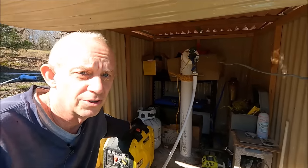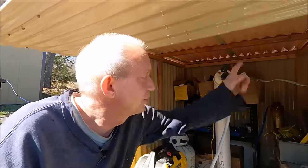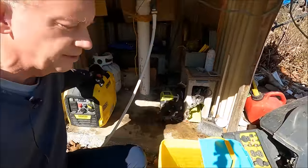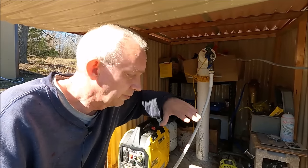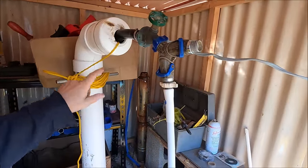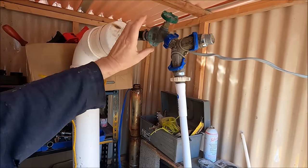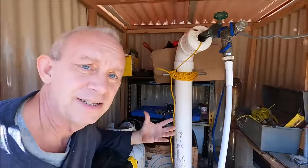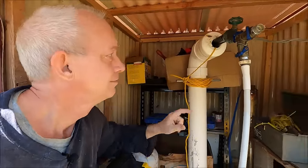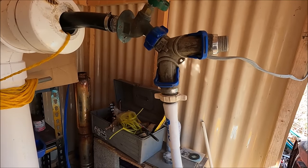I have a light switch here which runs down to the inverter. Each day I come out, turn on the inverter, walk down there — it's 100 feet down and 100 feet back up the hill — then I come up here, turn on the switch, water shoots out, and I let it run for a couple seconds into this bucket to make sure the water is clean. Now this well used to get dirty all the time — surface water would go down and contaminate it. Another issue is this pipe or the well pump can fall down. It's on a rope, and the rope stretches. A lot of people tell me to put a clamp around the pipe, but you're not supposed to put weight on the pipe. That's why you have a rope — the rope holds the weight. There are joints and connections down there, and if you had 200 pounds of weight on those connections, they could break apart.